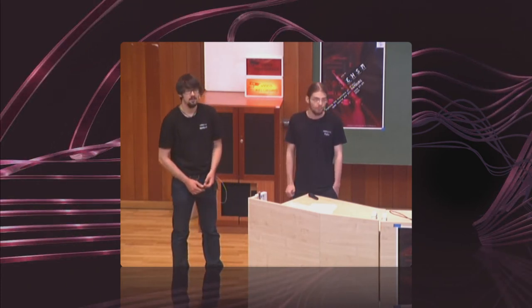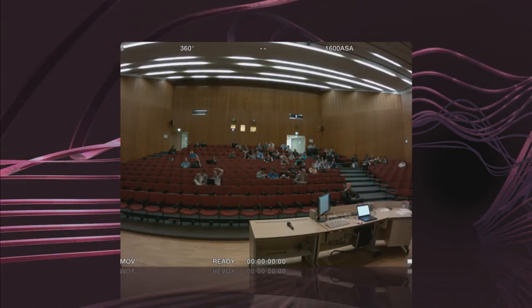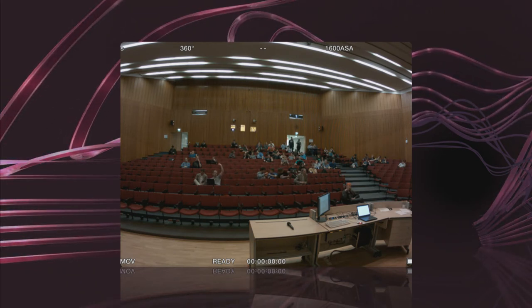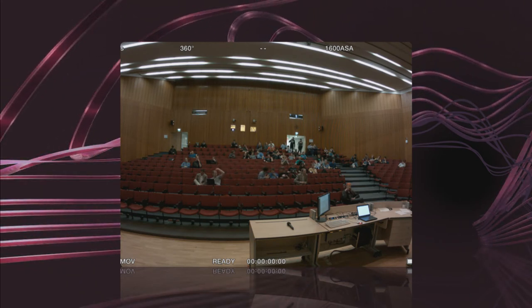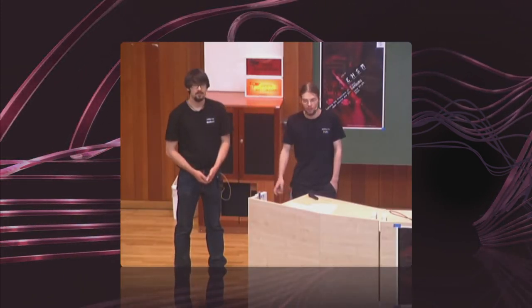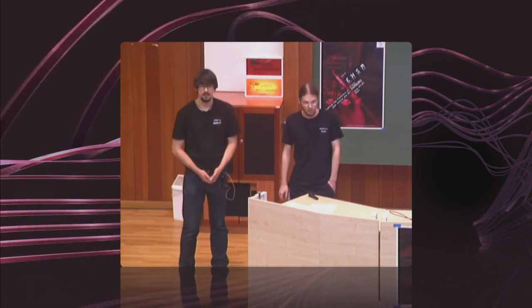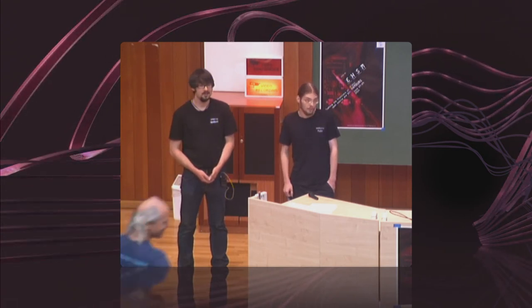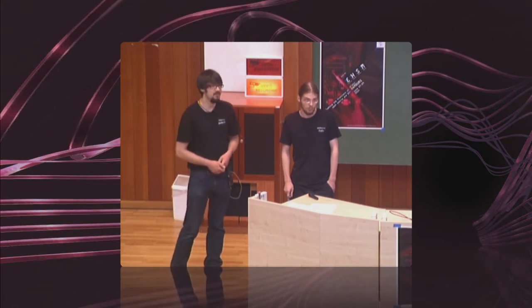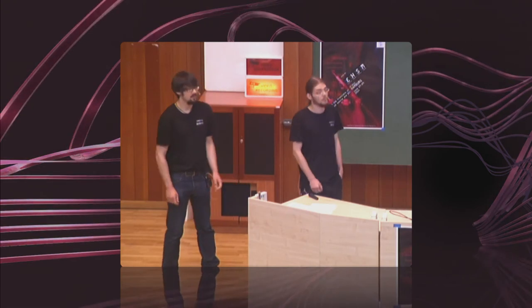And you put your own photoresist on it, right? No, we buy pre-coated PCBs usually, but you can use your own positive photoresist as well, or negative, however you like. Turns out that the laser transparency method is so common that coated PCBs actually cost about the same as bare PCBs. Why bother?